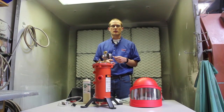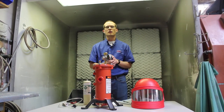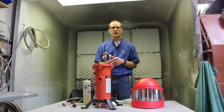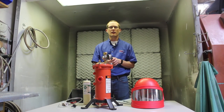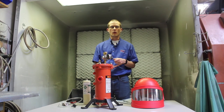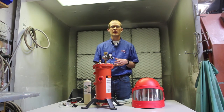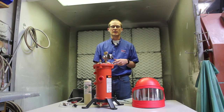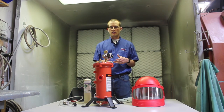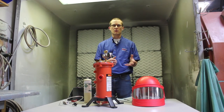for the air used for a supplied air respirator, including blast hoods for sandblasting as well as force-fed hoods for painting. What they're typically referring to in that standard is what they call grade D breathing air. Some characteristics of grade D breathing air are that it's free from oil to a certain extent, with very small allowable amounts of oil in the line, as well as water content and carbon monoxide content in the air. These are all issues that come with any oil-lubricated compressor, so there are really two ways to be safe when using a supplied air respirator.